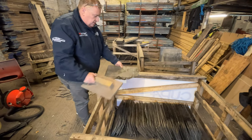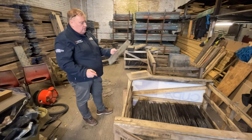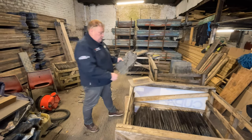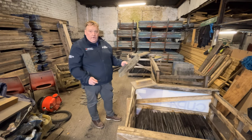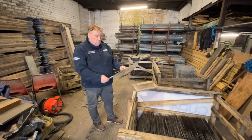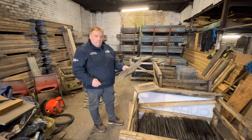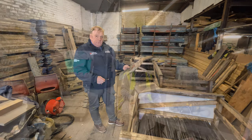And if we can dress that slate down, cut it up these lines, cut it across the head and put another couple of nail holes in it, that slate's good for either going on a roof that's actually got 14x8 slates on it, or it can be used for a repair in many slated roofs round about the town. Say bungalows, a lot of them have 14x8 Welsh slates on them. So I'll ask either Aaron or Kyle if they can cut the slate and reshape it into size.